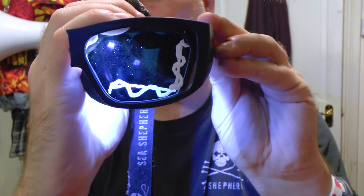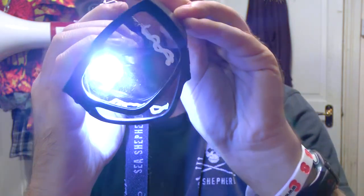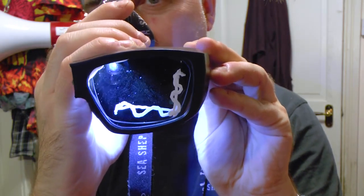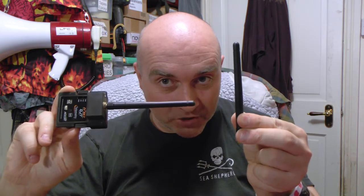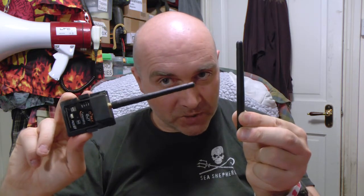See, it's almost killing it. Look, the light's there, it's nearly gone, nearly gone. Turn it, loads of light, turn it back, look, the light's nearly gone. And that's the magic behind polarization. So now, is it making sense? There's a magic spot that when you turn your antenna like that, disappears. The signal goes. And it's pretty low around here. There's going to be a magic spot where you're going to lose all the signal.